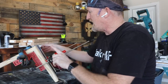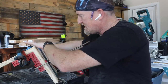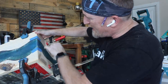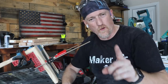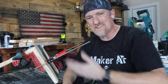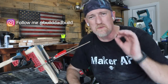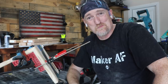Alright guys, so we're in the process of gluing this joint up. I have an issue though — this miter was like perfect, it was spot on. But when I was sanding the edges, I didn't take into consideration that the epoxy would sand faster. And even though I didn't sand very much, I have this gap here now. This is a horrible idea, but it's the only way I can think to fix it right now. I've come too far to scrap this project. Learn from my mistakes, kids — apparently don't sand the epoxy at all. I thought I needed to sand it at least a little so it wasn't so opaque. Maybe that was a bad idea. Probably. So what I'm going to do is mix up a very small batch of epoxy and pour it in here, and hopefully I can color match this well enough that you won't notice.